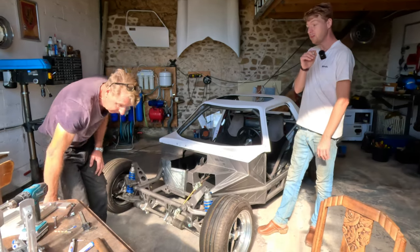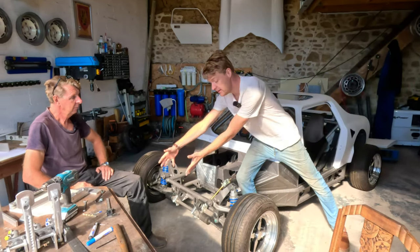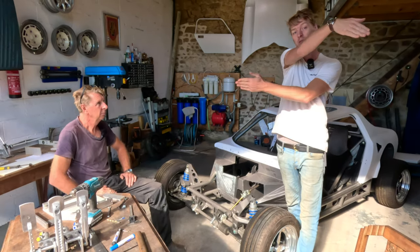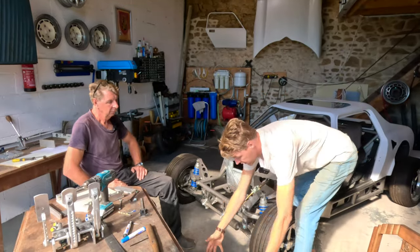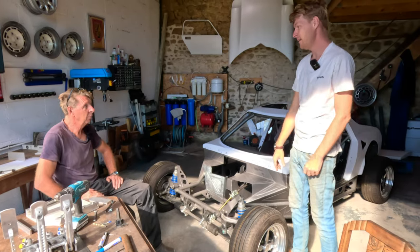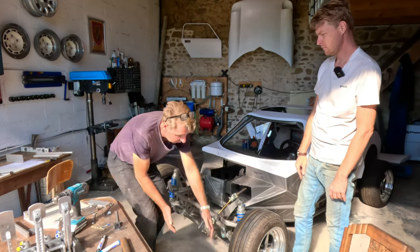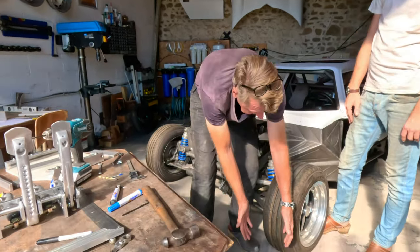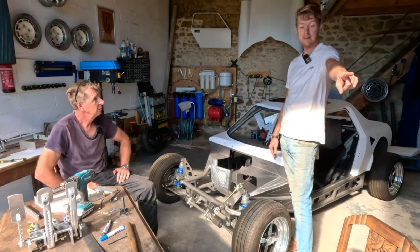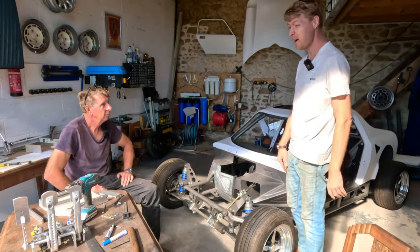And this is why all the people that said we should put fog lights in the mouth, no. Also, fog lights in your mouth suck, because when you move lights inboard, they're terrible for turning. So on a country road, when you've got really tight turns, you can't actually see down through the corner. You can't see your apex. And so our fog lights need to be in front of our front wheels, because no air is getting anywhere near those front wheels. In fact, if you go back to look at the old Group B Audi Quattros, where the front spoiler is, they used to have Cibie lights mounted on the bottom at 45 degrees. Yes, turning lights. Turning lights are superb. And that way you can actually see the ditch on the inside of the corner and you don't drop your wheel in the hole at night. It's in around here, that's very useful.